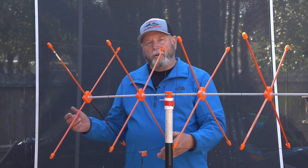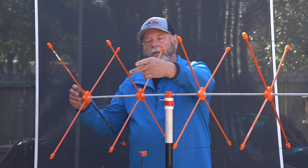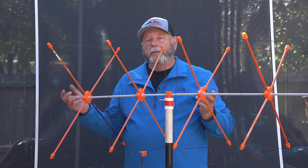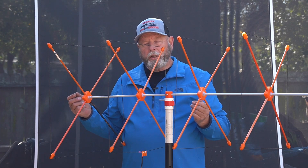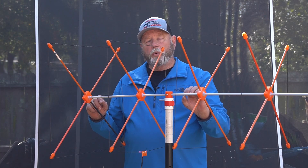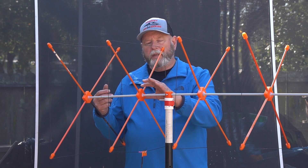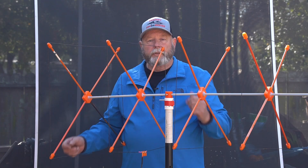It's in the horizontal position right now. When you turn it sideways there's a huge difference on some FM repeaters because vertical is loaded differently. On some repeaters I have a hard time reaching, it's actually three, four, maybe five S-units difference. Still readable, but for most repeaters within 30 or 40 miles I can leave it for sideband. I did put a little hot glue on — I may go to a square insert to keep things from rotating, since the round pieces don't stay set as well as I'd like.